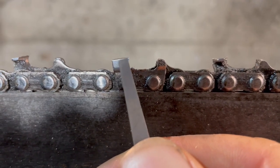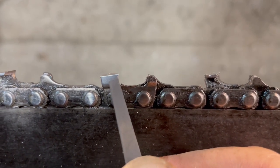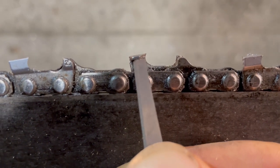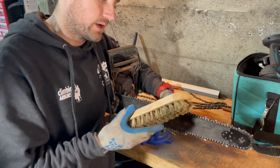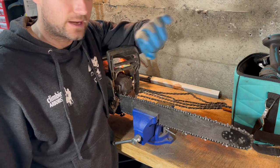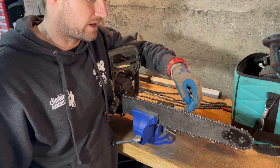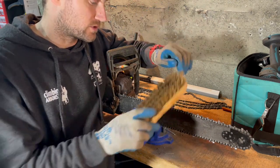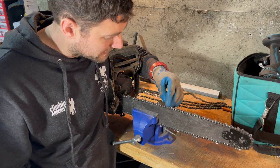This is what your teeth should look like from the side — you've got that nice rounded section there. If it's flat, that's not going to cut very well; you need that rounded groove. Once sharpened, find your starting point and go along with a little wooden brush, tapping those front edges to get any burrs and filings off. If you start cutting with loose filings still attached, it can slightly take off the sharpness of that edge. Just tap all those loose bits of metal still hanging on.